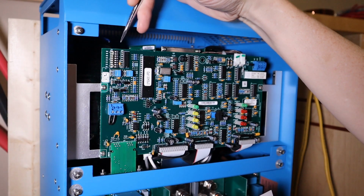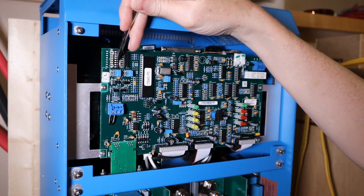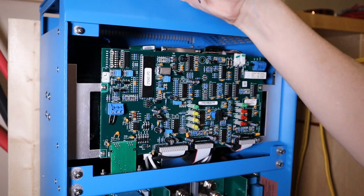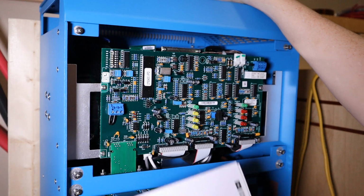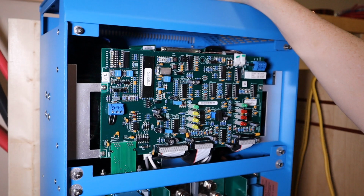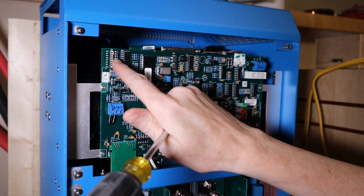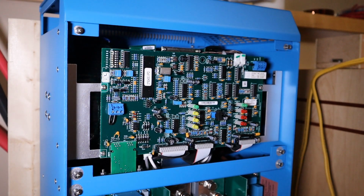8, 7, and 6 have to be off, off. Oh. Okay, so the manual said 6, 7, and 8. It said the AC1 input should be limited to 60 amps by default, but looking at the manual, that would be DS6, 7, and 8 all being set to on. But here they're all set to off. Manual, did you lie to me? Okay, well, anyways, let's keep reading.